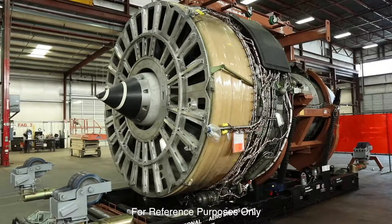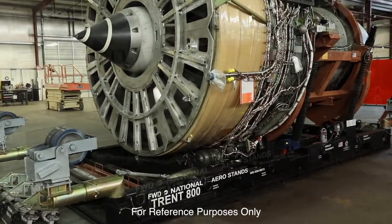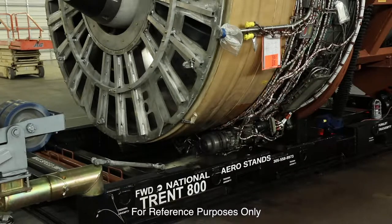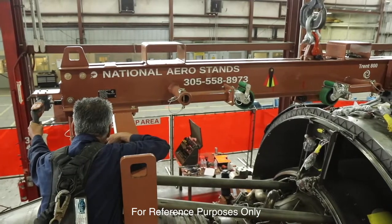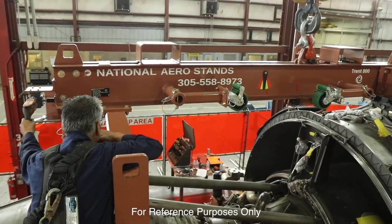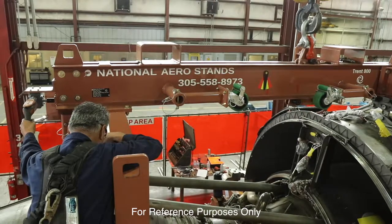At this time we're going to lower the engine off the crane. You're going to see the load on the engine favor the front end by the fan case and you'll see it start to dive in a downward position. You'll hear noise — this is perfectly normal; this is how this stand is designed. The full load is now off the crane and we'll remove the spreader bar. We're using a half-inch drill, which is the most convenient way to move the center of gravity pick point on the transfer beam. There are marks on the transfer beam which tell you where to set this lifting point when the spreader bar is empty. If you do not set it at the CG, you may cause damage to the engine, spreader bar, or employees if lifting improperly. Please follow the manual when setting the lifting point.